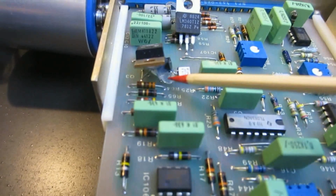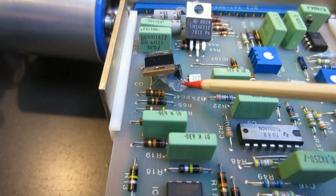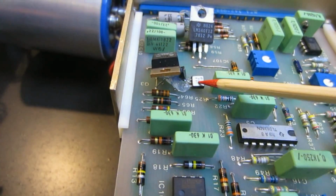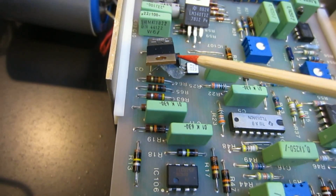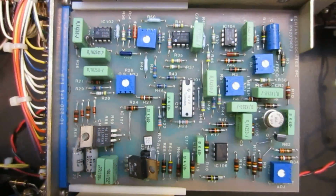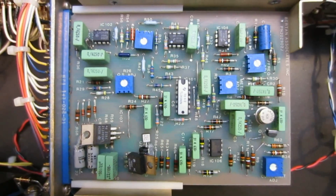But if you look more closely here, you'll see that there are some transistors. Oh geez, this is really crusty here. There's some hot glue, and glue down a 2N3904, and there's another transistor stuck behind this 7912C, the negative 12 volts regulator. So wow, the construction is not what I would associate with a name brand high voltage supply.